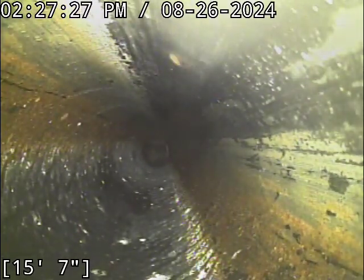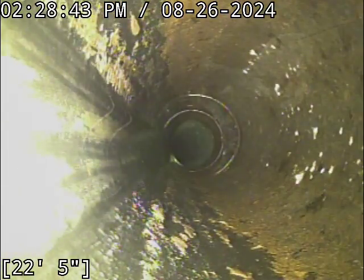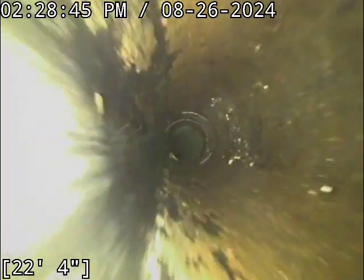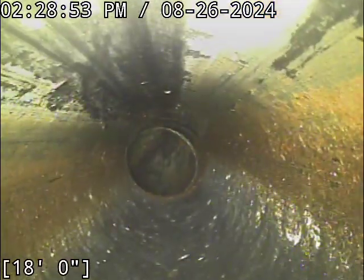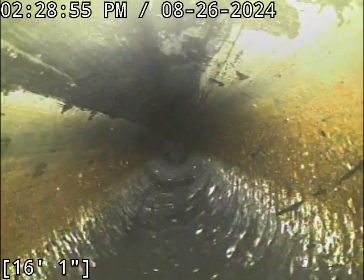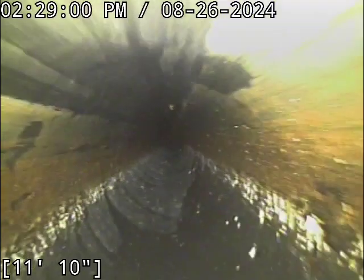And real quick here, just so I can give you an idea on the route, I'm going to do one more locate. It looks like the line jaunts into the driveway and then shoots down the driveway out to the street. Or something akin to that. At least it looked that way at the locate I got at the manhole. We're going to find out right now. Yeah, so right here where we are currently sitting is in the driveway. As you face this house from the street, where I was right there was about 2 feet in from the left side edge of the driveway. So it gets onto the driveway, not super far in, but it does go into the driveway.